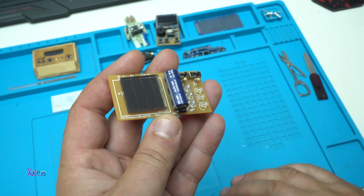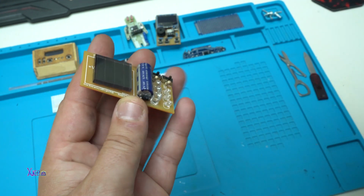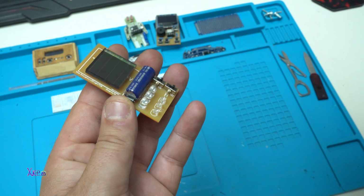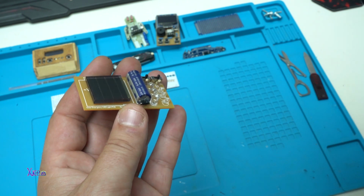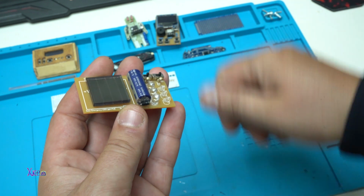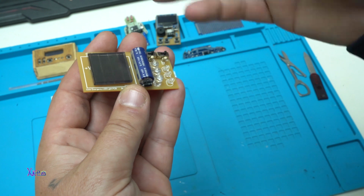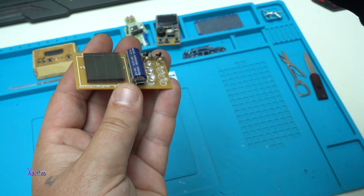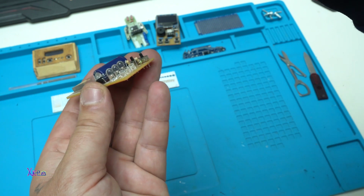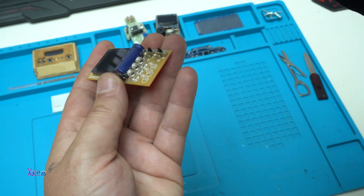And why is this device batteryless? Because I'm using a supercapacitor instead of a LiPo battery or nickel cadmium or nickel metal hydride, whatever. The supercapacitor can last many years, and that's why this is an emergency batteryless solar LED light with PCB board. That it's looking good.